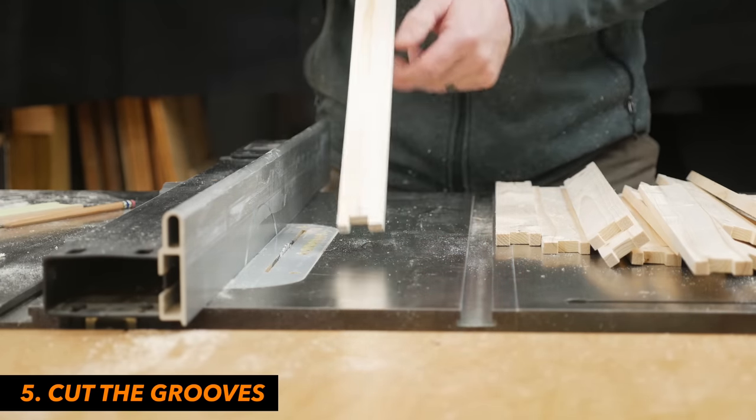My easier way to make the blocks is to start with strips of plywood and laminate them together. Once they're all laminated together, I'll have basically one long block shaped all the way down. I'm going to put a groove in the top and the bottom of this long bar by running it through the table saw, flipping it over, and running through again — a long extruded version of the block shape. Then I'll chop them up on the table saw and we'll have all our blocks. It was a bit messy, but it's going to dry up and then we'll do all the slicing and dicing.